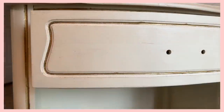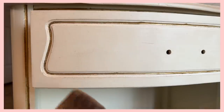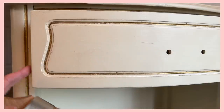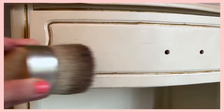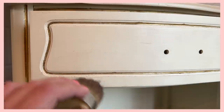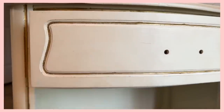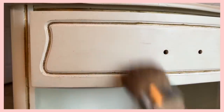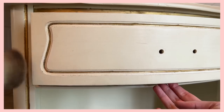If you've made a mistake or gotten the Rub and Buff somewhere you don't want it, a clear wax will just wipe off any of your mistakes like an eraser. I'm just flicking the wax brush along this fine line right by the gilding — using the side of your brush — and you can see it's starting to build up and give more of an antique look without going straight up and down over the gilding. Just keep building if you want to go darker — keep rubbing that brush over in different directions and it will build up that wax finish.